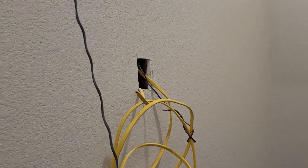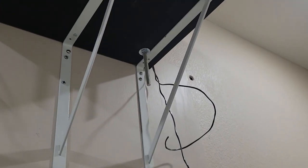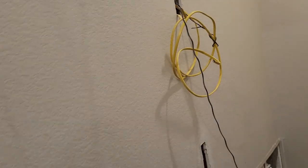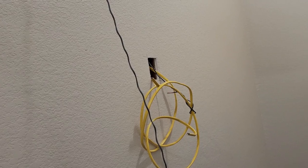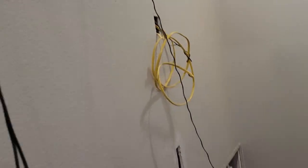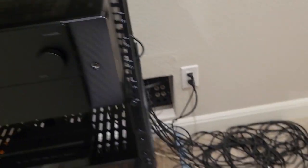There's a 12-volt trigger line that goes up for the projector and continues back to a connector on this panel, so it sends the 12-volt trigger to turn on the projector and also to turn on the exhaust fan up there. I just need to put a 12-volt contactor there to switch the power on for all of that.